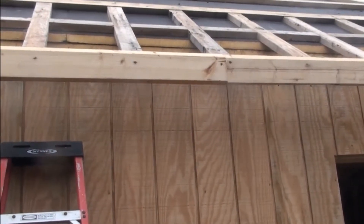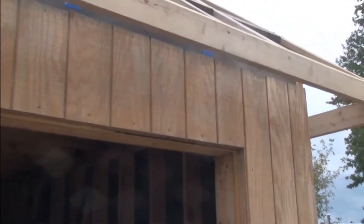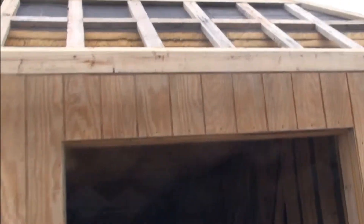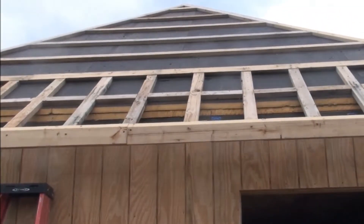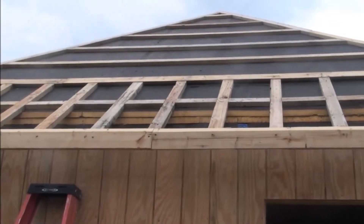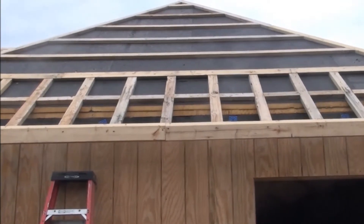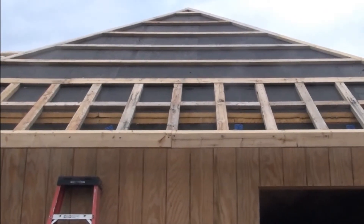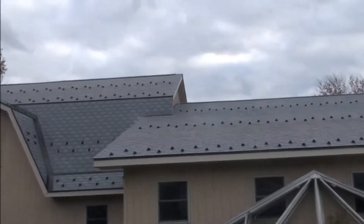When you do it the way I've done it, you don't have an overhang. In order to safely create an overhang, especially in the northern area we're in — last year we got 14 feet of snow over the winter season — you want a steep enough pitch so you don't have to shovel the roof off, and the structure needs to be strong enough to hold the weight of compacted snow, or have a steep enough slope with easy-to-slide material.